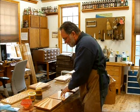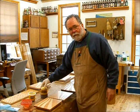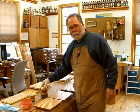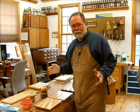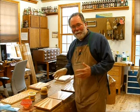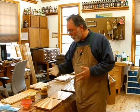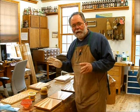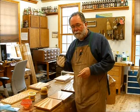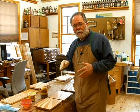Now, following the shellac, I'm using a mixture of 1/3 polyurethane varnish, 1/3 tung oil, 1/3 boiled linseed oil. And before I start getting all kinds of notes and letters saying that this is not food safe, let me tell you it is. I've done a lot of research into this, and of course shellac is very natural. It comes from a bug. But any finish today has no lead. That's number one. The old food safe thing had a lot to do with the lead that was used as a dryer in older finishes.